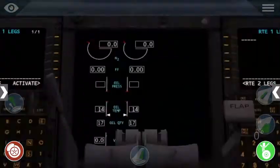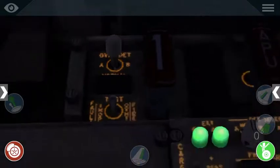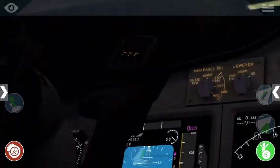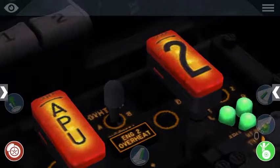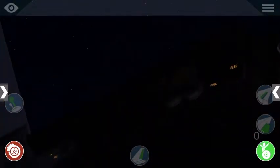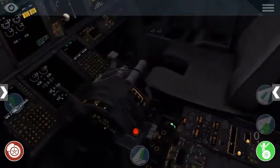Everything here looks good so we'll come down to the fire checks panel and we'll do a quick test of the fire equipment to make sure that the fire systems on board the aircraft are working. We'll go ahead and do a test of the lights here first, make sure that all the lights related to the fire systems are on. We'll flick this switch over and go ahead and get rid of the caution. Next step is to check the fire warning panel - everything looks to be good. We're going to turn these guys on to make sure they're all working, and they're good. I can hear the alarm - cut that out.